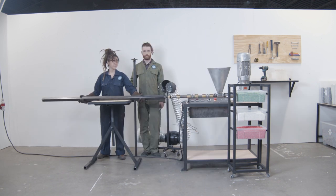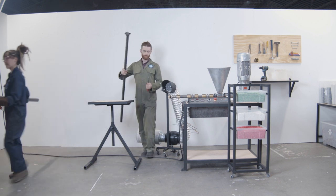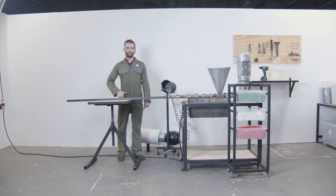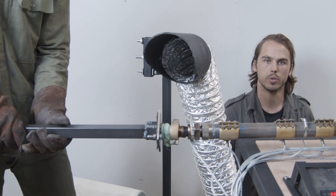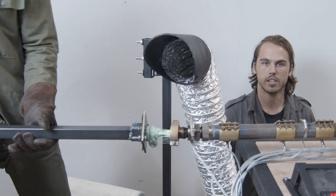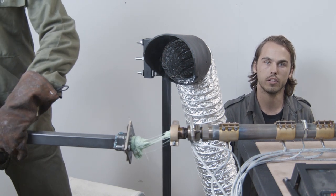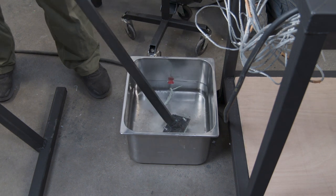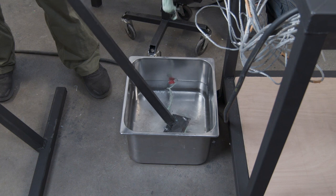Your mold's filled. Now it's time to remove it from the machine. As you wait for your beam to cool, attach a new mold to fill and continue producing. You might notice some plastic backing out of the mold when you remove it — this is a result of pressure that's built up in the mold while filling. A good way to stop this is by dunking the nozzle in a bucket of water for a few seconds. Some excess plastic may spill out while you're swapping molds, so keep the bucket of water underneath the nozzle to capture anything that falls. Cooling the excess plastic right away helps prevent fumes and keeps the pieces small and shreddable so that they can be recycled again.